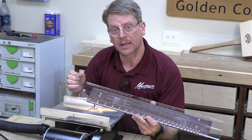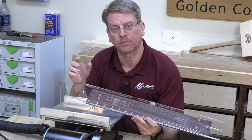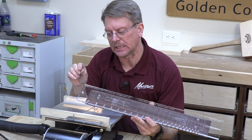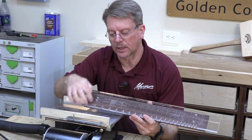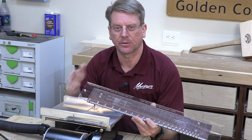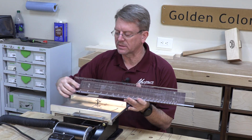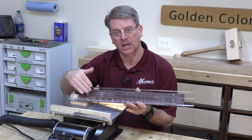And when I'm done with that, I will have just over 1/8 of an inch. I like it slightly fat. It's like 9/64 of an inch for my nut, that will be the dimension. Now I'll also make multiple passes within that range so I can clean it out and not have to take a chisel to it.